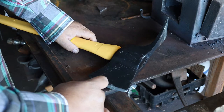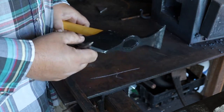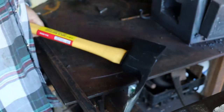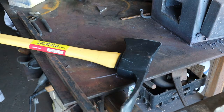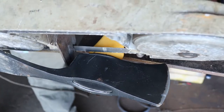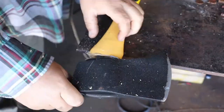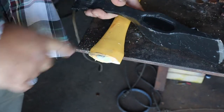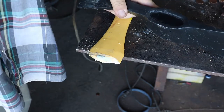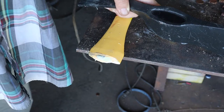So this edge right here didn't deform any, but I don't like that angle. Now this edge right here is terrible — that's just too steep. It seems to be hardened, but this edge geometry is terrible on both sides. And this fiberglass handle — I don't really do fiberglass handles, so that's gotta go. The band saw is probably gonna be the best for this. There's all kinds of tricks for getting it out — drilling holes and chemicals — but since we're probably gonna re-harden and temper this, I think I know an easy way.